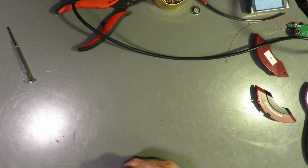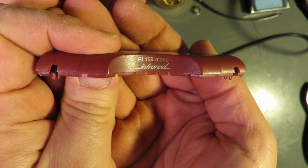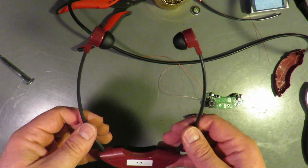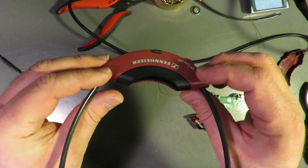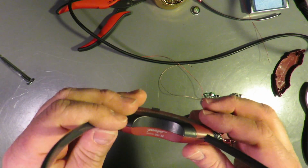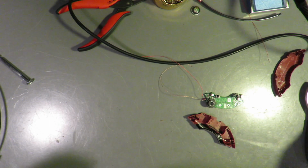quick recap. We took two Sennheiser R150 mono infrared ear hole receivers, each of which only had one working earpiece, and we salvaged that. We salvaged the working earpiece from one, put it into the other side. It's just a very quick solder job, and two screws and a little bit of prying. And we have a working one made out of that. Now that's important because these are discontinued. I can no longer get them. There are replacements, but